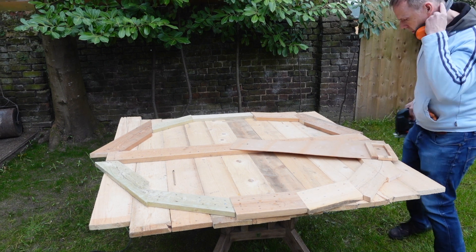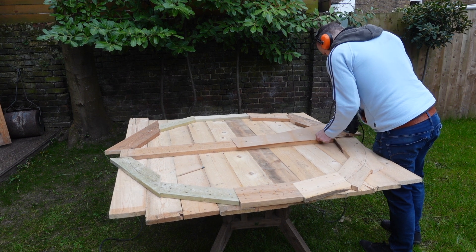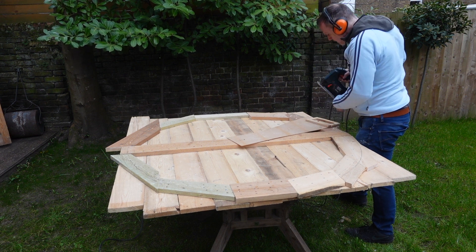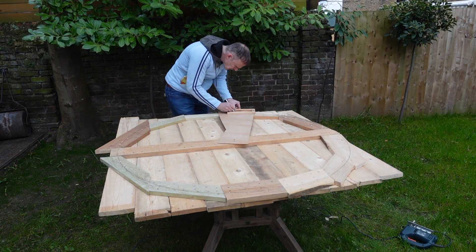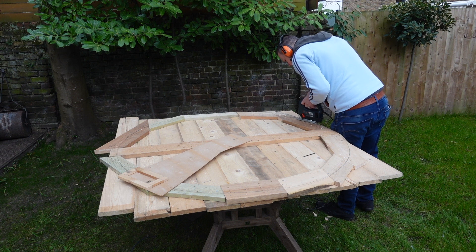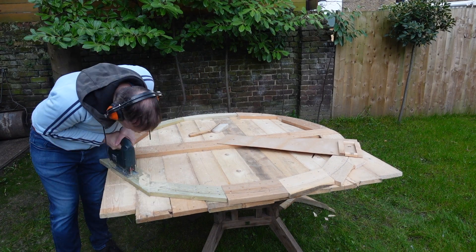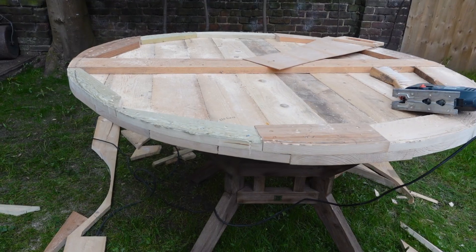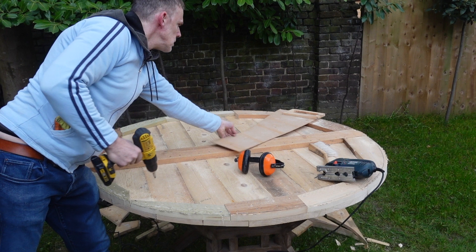Well that seems to work — now to cut the table round. I thought this was meant to be quick, but it's not quick at all. I don't think it's even working. I'm going to give up on this idea — I'm not getting any ideas from the internet again, apart from my channel obviously. But I'm going to use this pivot tool to draw an exact circle — it works well for that. Now I'm just going to cut the table top with a jigsaw directly, making sure I follow the line accurately. That's worked — I've just got to tidy it up a little bit and sand it down so it's nice and flat and smooth. I'm going to get rid of this tool; it was rubbish, but it was quite good for drawing a perfect circle.